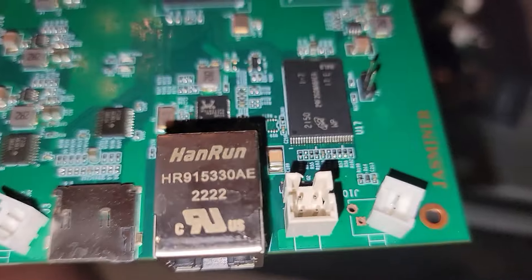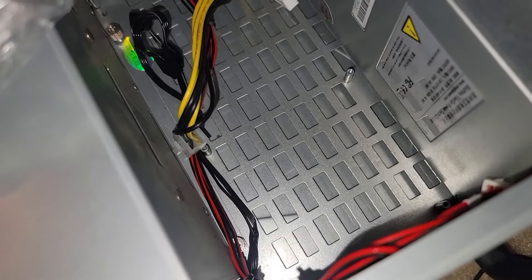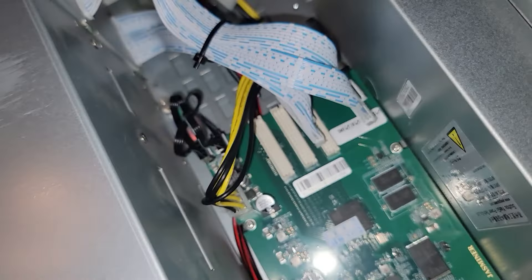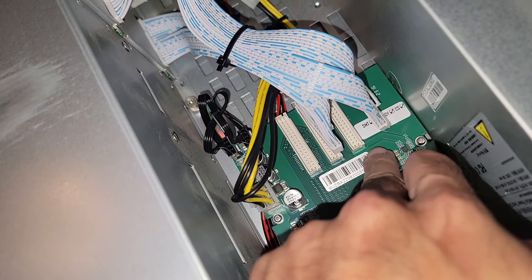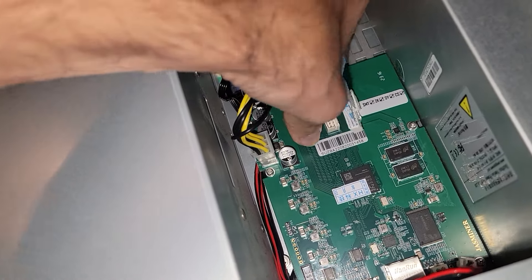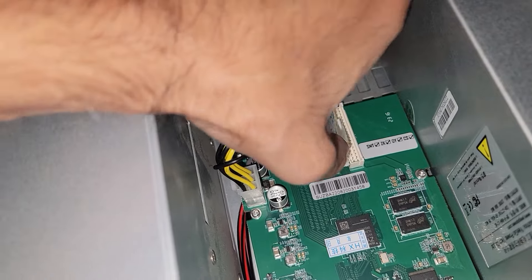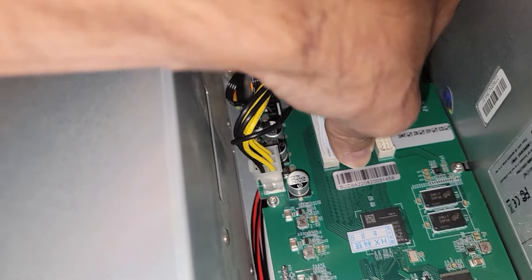Let's see if you can tell me what that chip is in the comments. We're going to get the new board installed, mounted, and see if we can get this system rebooted and connected via the network. Note to self: these little red and black connectors only go in one way — if it doesn't go in smoothly, do not force it. Same thing with the six-pin and the PWM. These connectors were originally in the bottom and middle slot, not the top. I'm not sure if the top slot is for a specific reason, but for example on the EPIC control board for the Whatsminer you're not supposed to use slot 0, only one, two, or three. Take a picture before you take everything apart so you know the exact order it needs to go back in.